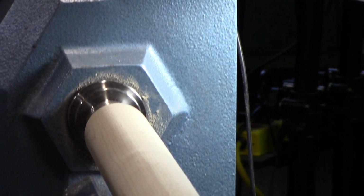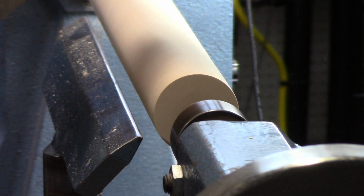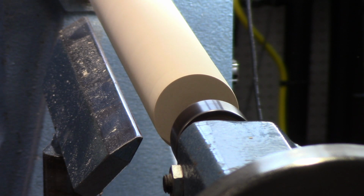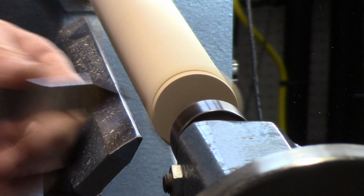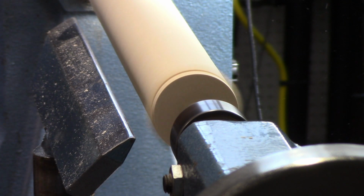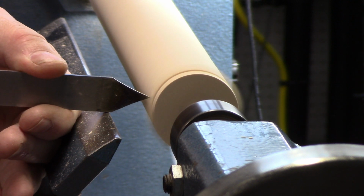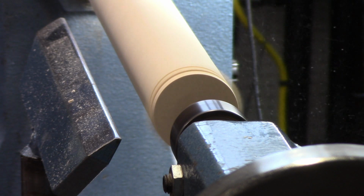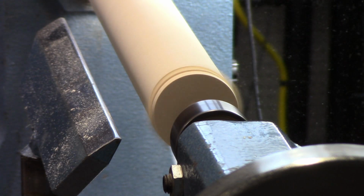So what I'm going to do is get myself in the ballpark for this. When you're using a parting tool, it usually doesn't matter if you get that much of a clean cut on it, but at times if you're doing boxes or something like that, the fuzzies that the parting tool sometimes will leave, like this, are a problem, and there's a way you can get rid of that. I'm going to move my tool rest back a little bit because this one has a little bit longer point on it, and you don't want it resting on the point, you want it resting on the flat part back here. It's still a little bit too far away. All right, by just putting it in straight like this first, you eliminate those fuzzies, and then you can go back and actually use it like you're supposed to by just lifting up the handle, but you don't have those fuzzies to deal with anymore.